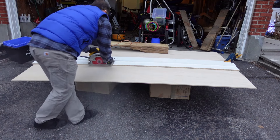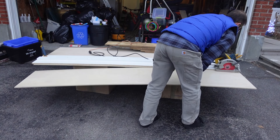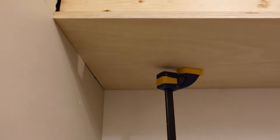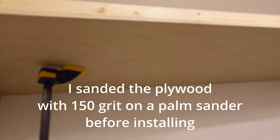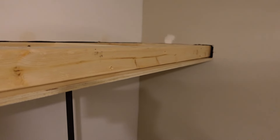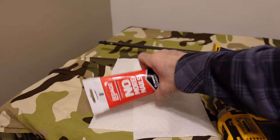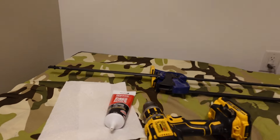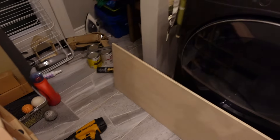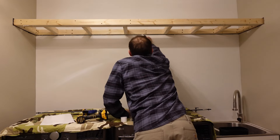That cut is 17 inches in width. Now because the shelf is actually slightly less than 8 feet, I also use the same cutting jig to reduce the width by about 4 inches or so. I'm actually going to put the bottom side of this shelf in first, just so if I need to do any adjustments I can adjust the top — it'll be easier to move the top around than the bottom. You can see there that I put the second two by three up front. I was just going to let the shelf cantilever a little bit, but decided not to. Before I fix the bottom of the shelf to the framing, I'm going to be using some glue and some pretty small screws — I think they'll hold a little bit better than small nails. The first thing I'm going to do is put some no-nails adhesive on all the two by three framing.